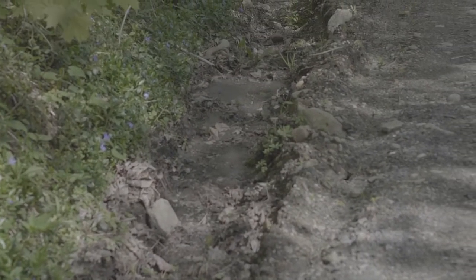What often happens in the winter is that our tire tracks, the pressure from our car, erosion starts to press down and create a channel for water to flow through. In addition to those tire tracks, you also get from the plows pushing the snow along, which we need them to do, a buildup of material on the edge of the road, a small berm of road surface material that can block water from flowing into the ditch. So what we'll do is we'll just cut small notches, and then we'll eventually get the whole road regraded to have that appropriate shape. You can also cut the berm down by hand depending on the length or difficulty of the driveway.